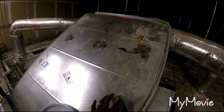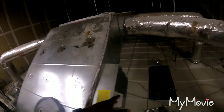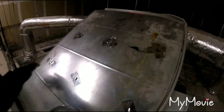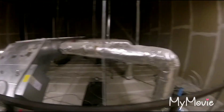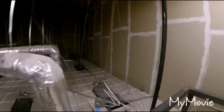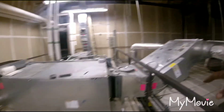I'll do a video on the duct traverse too. It's a formula — you put in the numbers and take the square footage of the duct, and that's how you get your supply air reading coming out of the air handling unit. You should get 1750 here. This is a common return, so the returns I showed you with the one line will be perforated grills somewhere in the space.